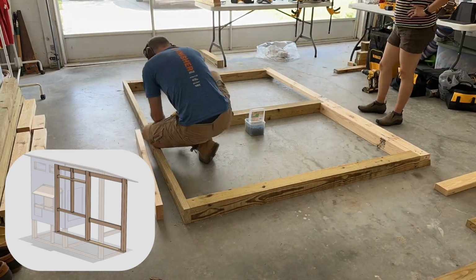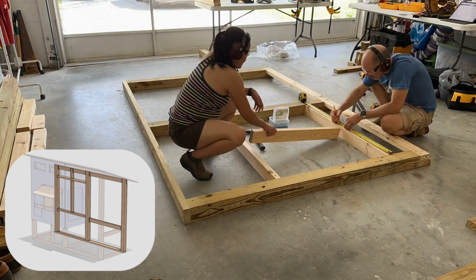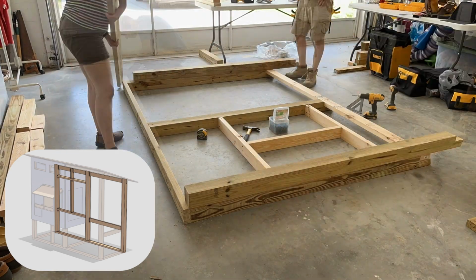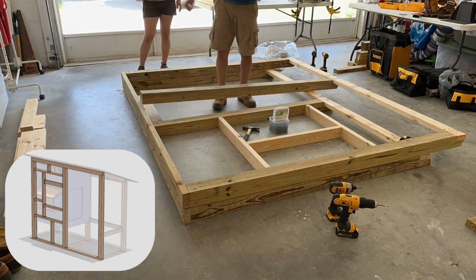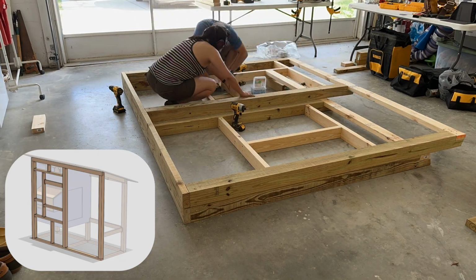Using the pre-cut pieces as temporary spacers to position adjacent parts helped us keep everything square in the first wall we built. It came out so well that we used it as a platform upon which to build the second wall. We just lined everything up as we built, and the second wall came out nice and square as well.